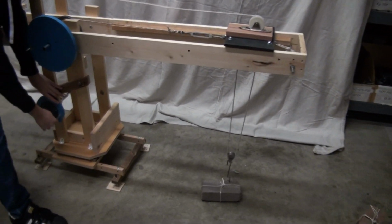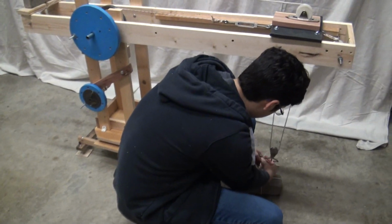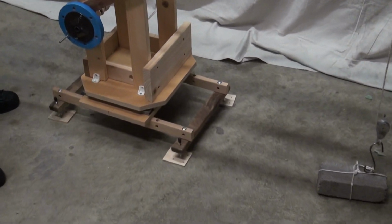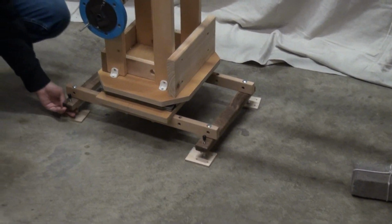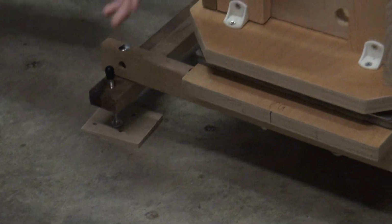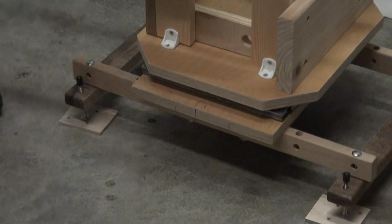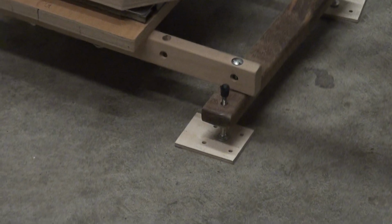Clutch of the crane is still the same, like the automatic brake we have here, so you're clicking. And yeah, hook on the load, and then tell me about those pads you have underneath the outriggers. Yep. So if we imagine this crane is sitting on asphalt, and it's 100 times heavier, 100 times bigger, and we had the same kind of outriggers without the pads, what would happen is, because these outriggers are so small, all the force of the crane gets shoved into the ground and digs into the asphalt, and it could potentially make it tip over. By having these pads, we distribute the weight evenly over a larger area, so it doesn't dig into the ground as much.